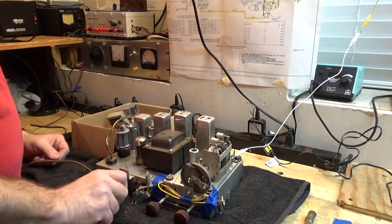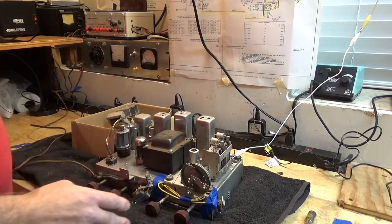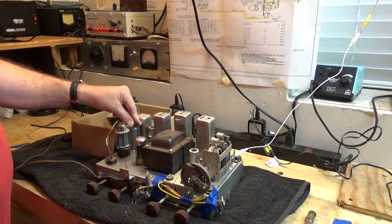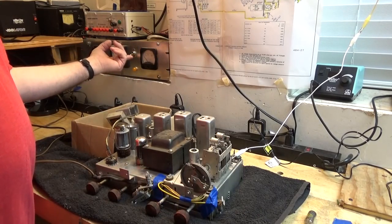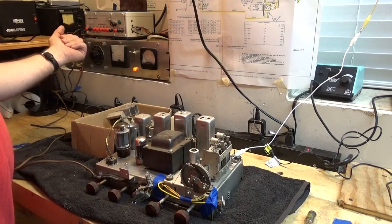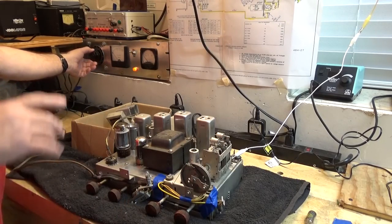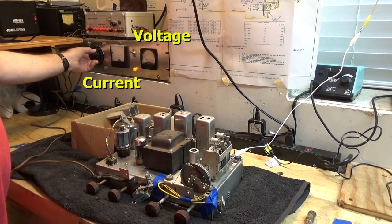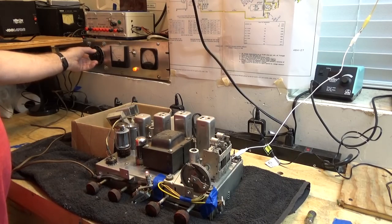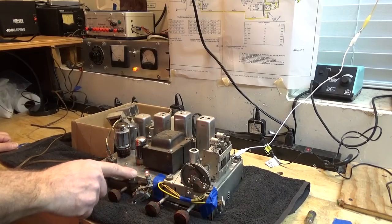Okay, radio is on. I've got the knobs on here — John from Arkansas taught me that a long time ago: it's always better to have the knobs on when you're operating the radio, even if it's not a hot chassis set, just a smart thing to do. Here we go with the variac. I'm going to come up slowly because I have a whole bunch of new electrolytics in there and they need to soak in a bit. Let's come up to about 45 volts — current is coming up slowly like I expect, no spikes yet. We're about 45 volts.